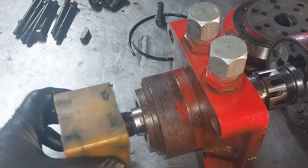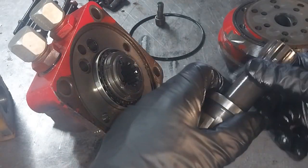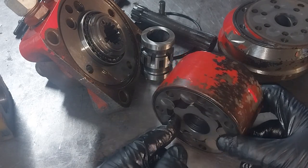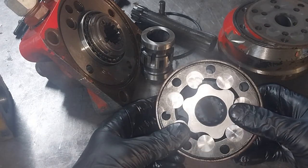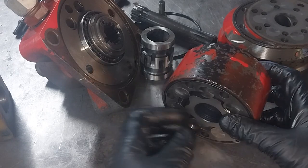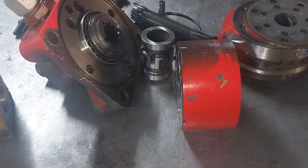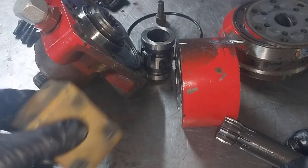It also rotates this distributor valve, and then obviously comes out here and creates your rotation. This is all working up to 200 bar, which is about 3,000 PSI. This unit is sized at 315 cc, so to complete one revolution of this internal rotor you need 315 cc of oil. Some of these rollers are loose, some are very tight — they're made to very tight tolerances to minimize internal oil leakage and transfer maximum torque through to this output block.